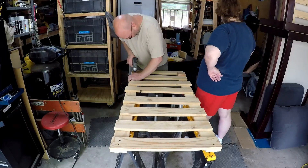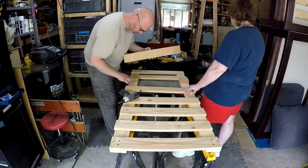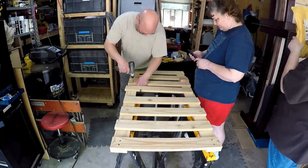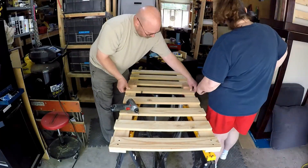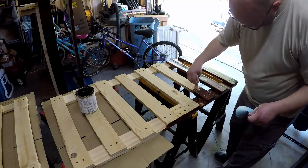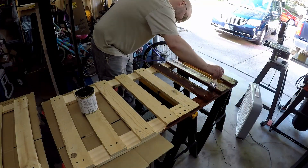The final piece to build was the back supports. This is all 1x4s with horizontals across top and bottom and then vertical slats spaced basically a 1x4 width apart. My sister came over to help with those. I glued and screwed all the pieces together, then finished them, and once the finish was done and I put a coat of wax on them, I screwed them to the bases.